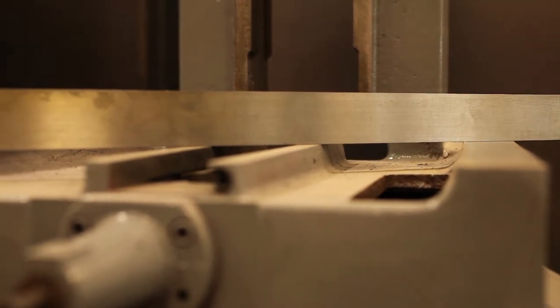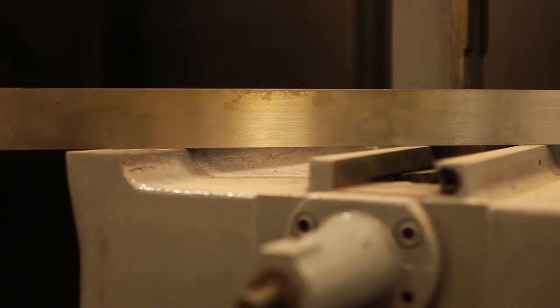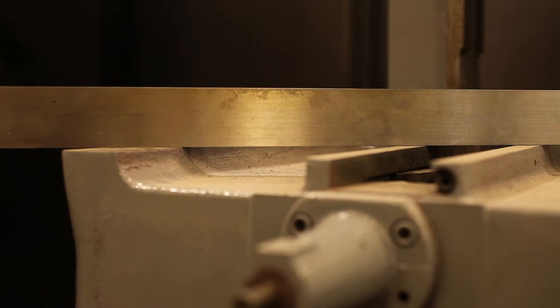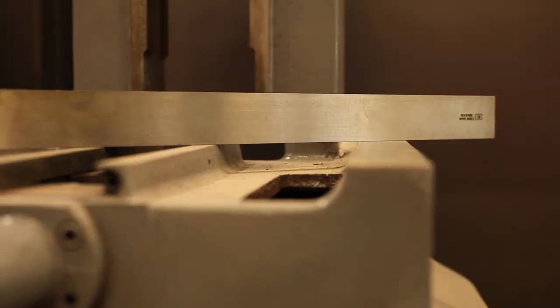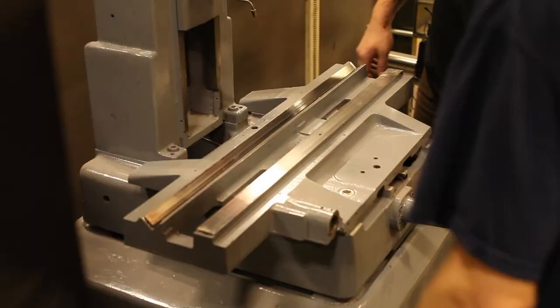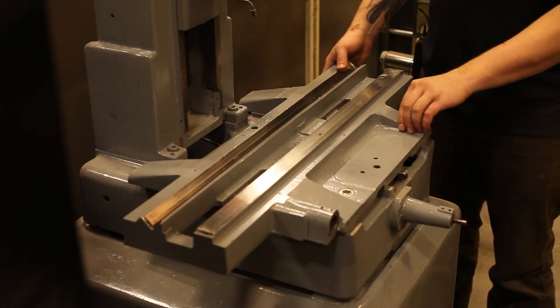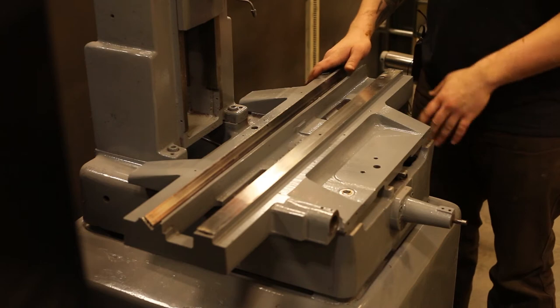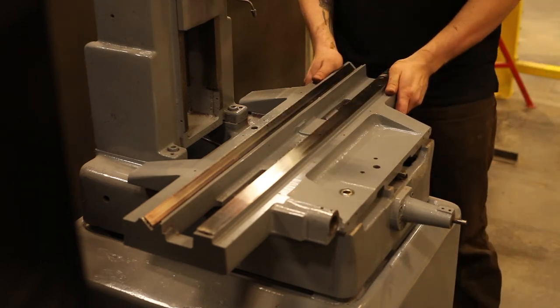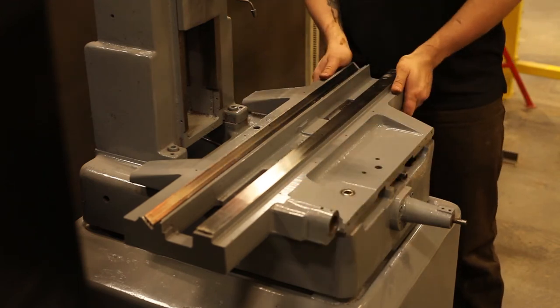The surface grinder is pretty level. I guess I need to put that tube in there with the other bolt and put the bed on to see how it sits, and that will determine how much I might need to adjust any twist in this guy. I put in the twist mount in here, just lightly snug. It's not even torquing this at all. But that feels very flat. I mean, before it was extremely bad. It seems good. I think it's good to go with.